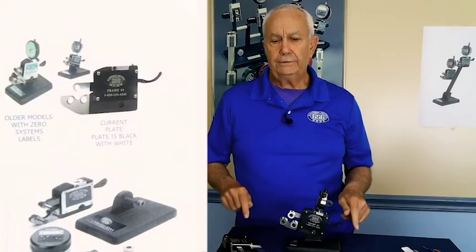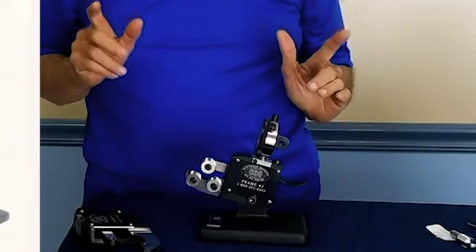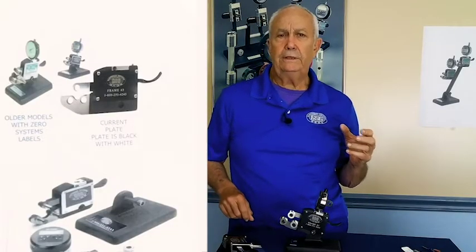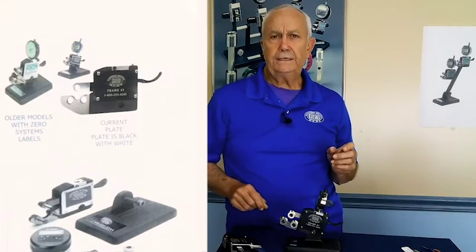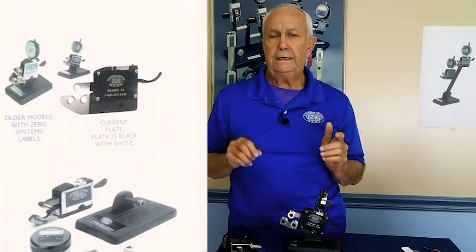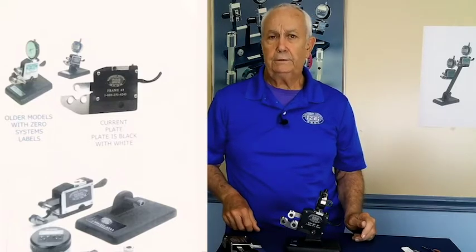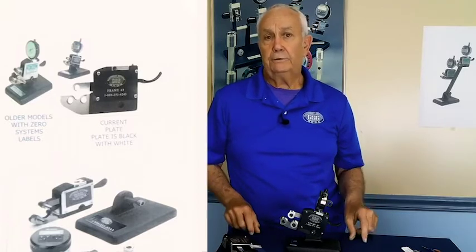Level 22 and level 23 require that all elements of the thread be in tolerance. Level 22 allows you to use a go gauge. You cannot be out of tolerance at a single point at your maximum material limit if it will go into a go gauge. However, the minimum material limit, the functional size of an external thread, is larger than a single element. So level 22 requires that you be within size at all aspects of this thread. You can use a go ring, but you have to check the pitch diameter at a single point with level 22. Level 23 does not allow the use of functional gauges at all, at least not functional fixed limit gauges.